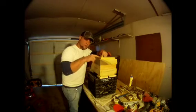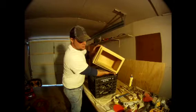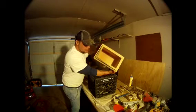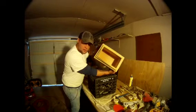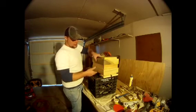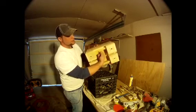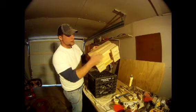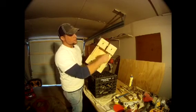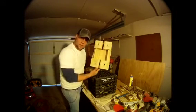This here is simply a 3/4 by 3/4 to help create detail and lid and cover the exposed plywood edge. And then this piece here tucks under the inch overhang, gives me a 3/4 by 3/4. Then I put little nailer blocks in here and attached 4 feet.